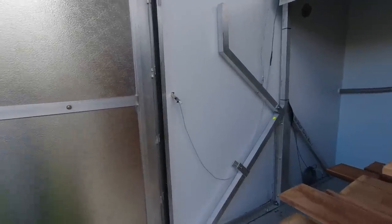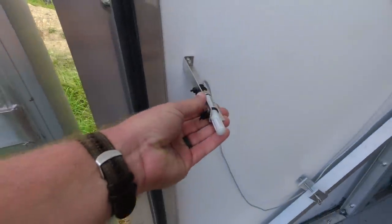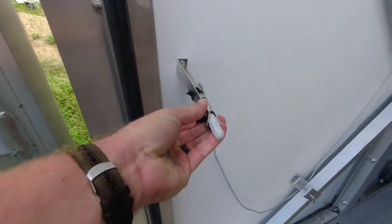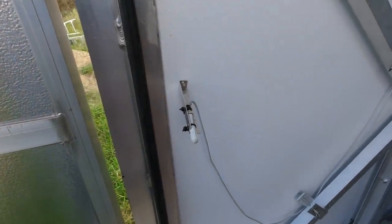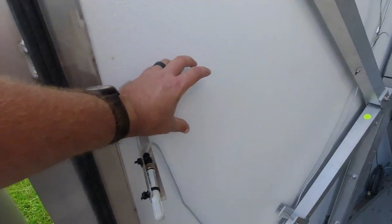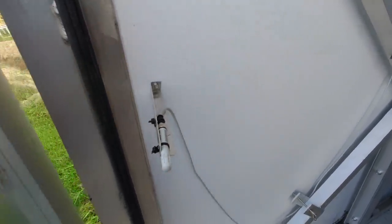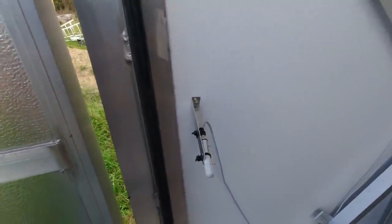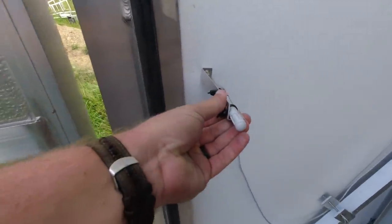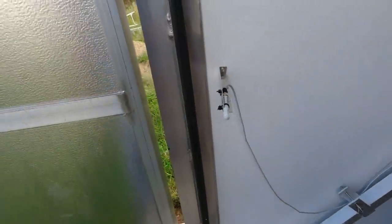Now with this L200 Pro there's a big improvement, and that is this right here. This little instrument is an electronic wet bulb. For you guys running Nyle kilns, you know what I'm talking about when I say a wet bulb — you usually have your little water vessel full of water collecting a moisture content reading for your wet bulb. On this kiln, your dry bulb and wet bulb are both read through this one little instrument right here. It's a really nice feature — keeps you from coming in here and having to fill up that water as it evaporates.